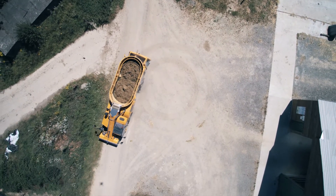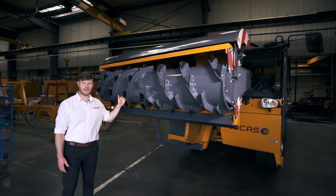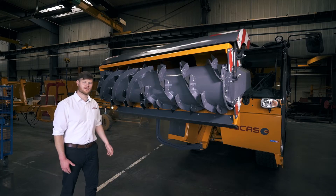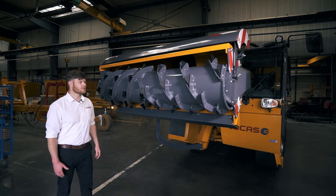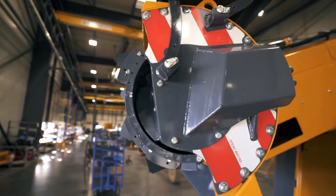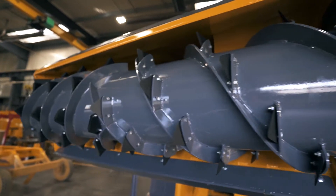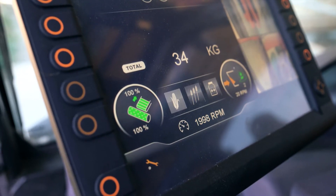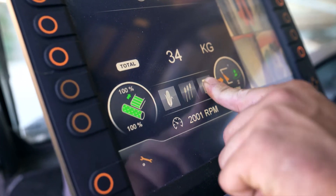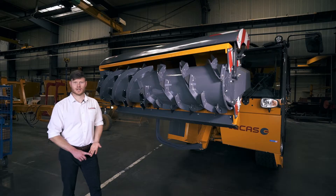There's also four-wheel drive to handle the roughest of terrains. At the front we've got the mill head. It's 625 millimeters in diameter and has 54 V-shaped blades. The working width is two meters, which means quick and efficient loading of clamp silage. The loading speed can be programmed from the tablet inside the cab.